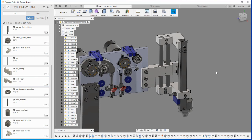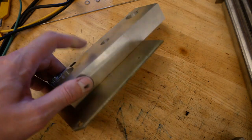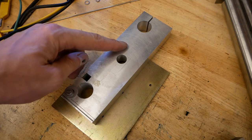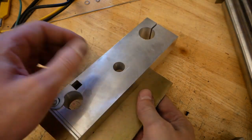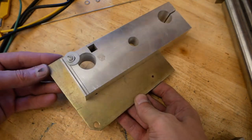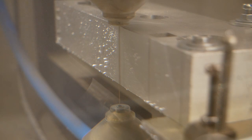Then let's do the axle clamp — that's this small part in the middle. Here's an old part that I have. It's 30 millimeters thick, so it's the right thickness and I can use this to make the part from. It's a bit small and short, so I added an adapter plate so I can easily mount it on the EDM machine. I mounted the block and it's close to the window so I can make a good arc shot.